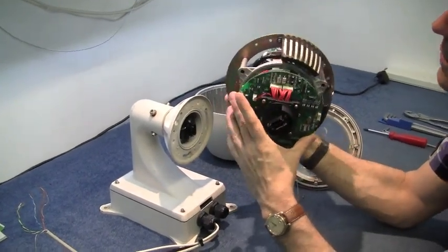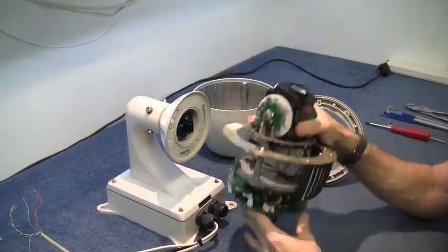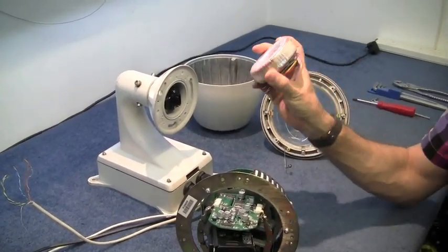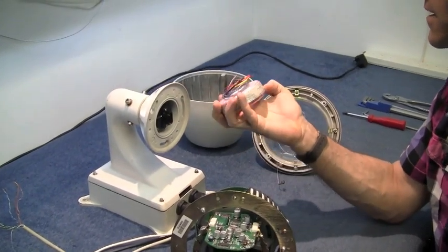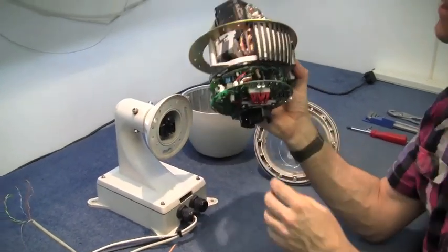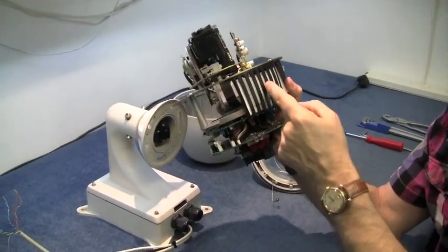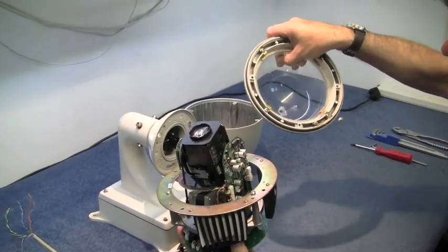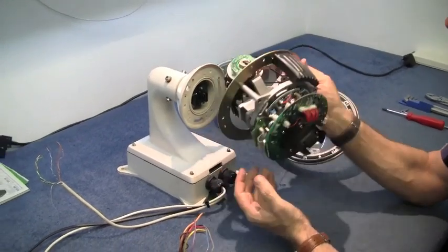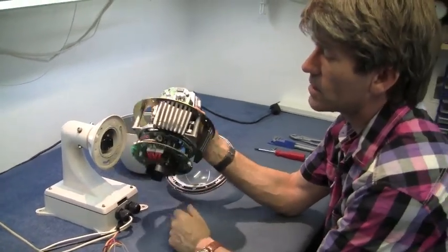Now this is 24 volts AC, so I haven't got power on demand for that, but I have got a toroid here and I reckon it's got two 12s on the secondary — I reckon we'll be able to knock something up with that and get this thing actually powered up. I've also noticed there's a couple of little baskets in here with silica gel to stop moisture building up on the inside. Some cameras have a fan and a heating system — a huge 5 ohm resistor or whatever — just to keep it warm inside. But this has just got the silica gel.